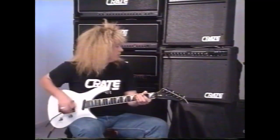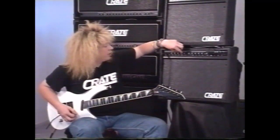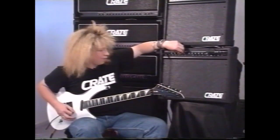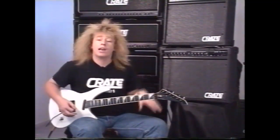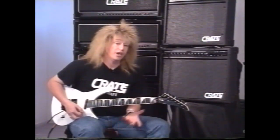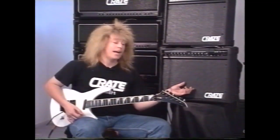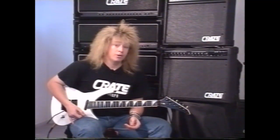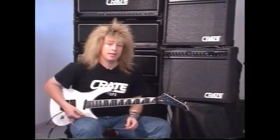I'll just give you an example — I'm going to play just a chord. If I'm turning the shape matrix, it radically changes the way your amp sounds. With varying your high and low end with your shape matrix, you can pretty well pull any sound you want. So you can set up any sound you want in a little tiny 80-watt amp, which is very powerful for its size and very reasonable in terms of price. It's a channel-switching 80-watt amp. It contains an Eminence speaker, US made. It has a line in and line out for either recording or you can run your effects in that as like a variable effects loop. It also has a reverb function and a push bright switch which works on your clean channel.